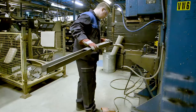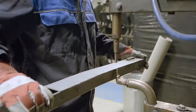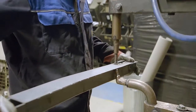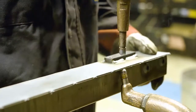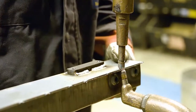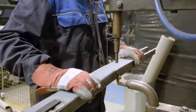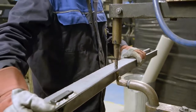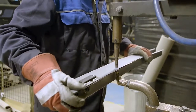Both of these manufacturing methods use a technique called spot welding. When the operator presses a foot switch, two copper electrodes are brought together by compressed air and an electric current is passed through the tips at the point of contact. While the voltage is quite low, the current is very high, typically between 5 and 10,000 amps. Heat is generated in the weld because the combined resistance of the steel panels and the interface between them is relatively greater than the resistance in the copper electrodes. The heat is high enough to melt the steel at the point of contact and so weld the pieces together.